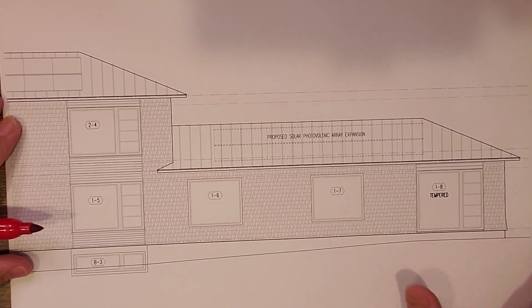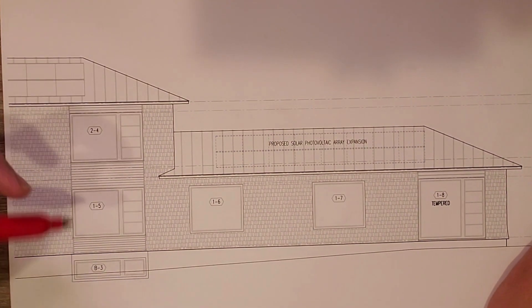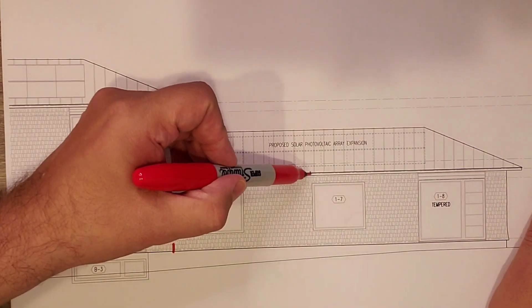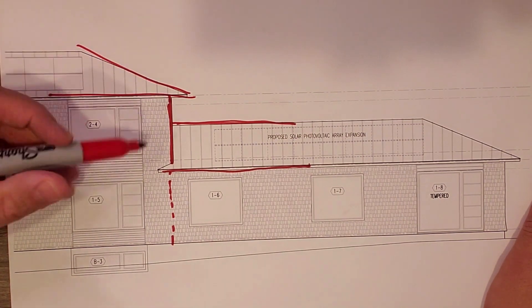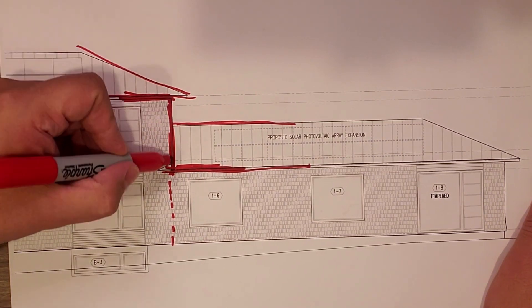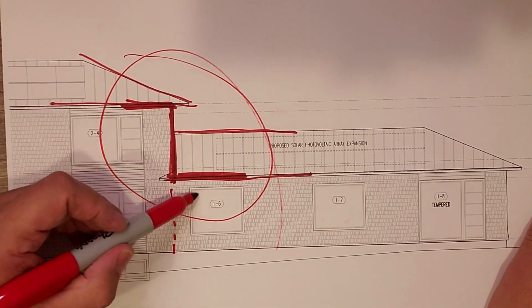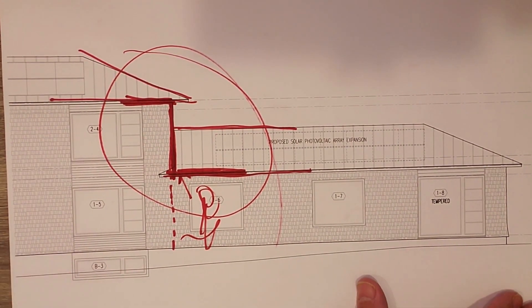I have a number of drawings here. I created a partial elevation image to explain where we are in the building. You can see the two-story wall, the first floor in there, the one-story roof system that comes crashing into it, and the second-story roof system. What we really care about is what's happening to our air barrier in this ceiling, how do we connect it to that wall, and then how do we connect it to that ceiling so we maintain that continuity. That's the place we're talking about today — we're down in that room standing there looking up. That'll give you the exterior orientation.